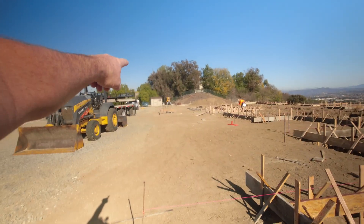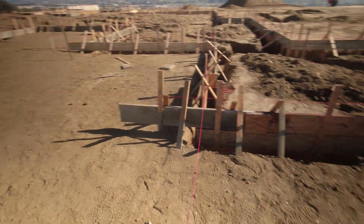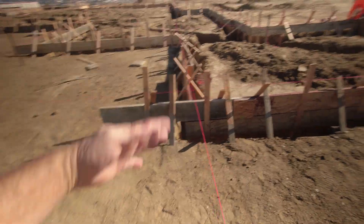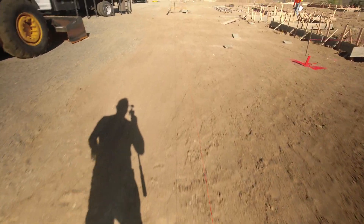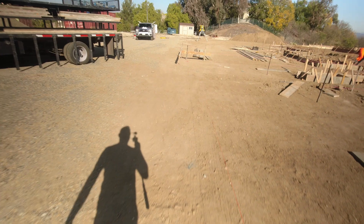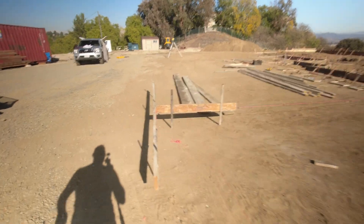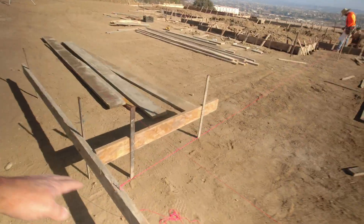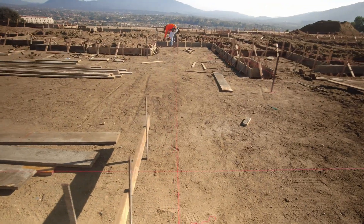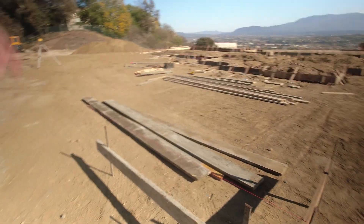This project is quite long — it goes down about 185 feet. So they divided it in two. You can see these strings going all the way across. They basically made two squares around this house and cut one in half right across the middle. They set these batter boards to height with a laser, so all the strings are the same. This squares out one section and then the other section.